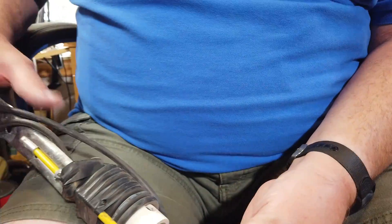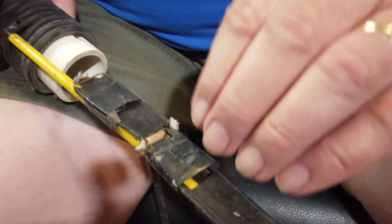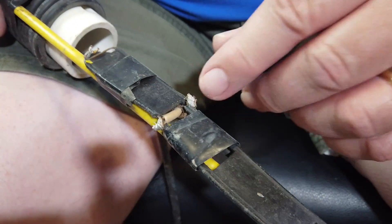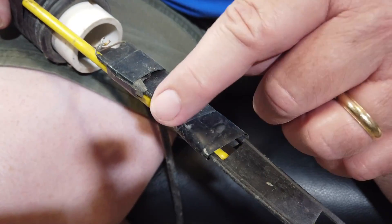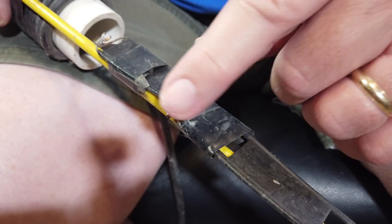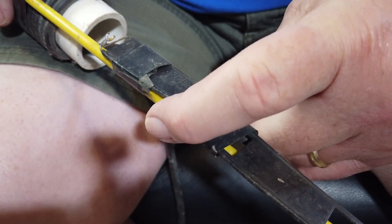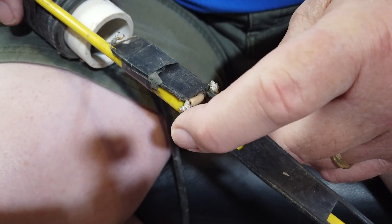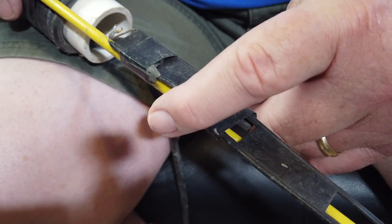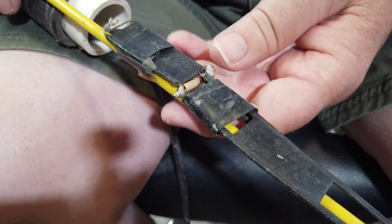The other way of sending it down is a push-pull, a balanced type thing, where this goes opposite this, and then this goes opposite this. So if this is positive, this is negative — and that happens at radio frequency energies. In this case, in the two-meter band, around 146 megahertz, so it's going quite a bit.